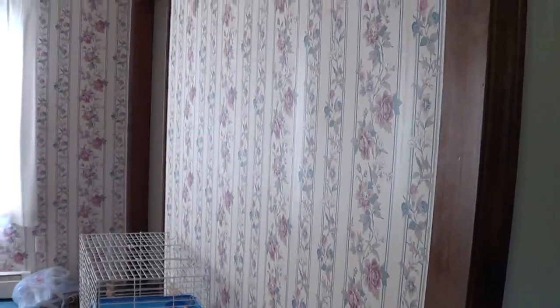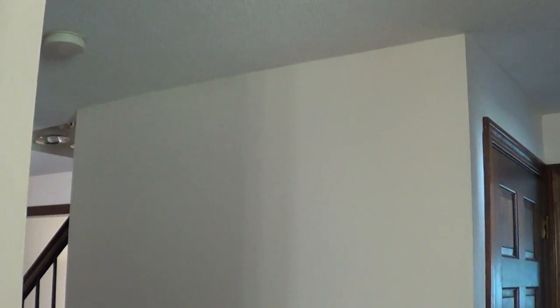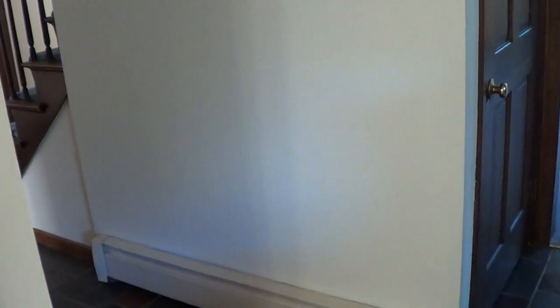This is the dining room — the last paper in the house right there. The hallway was super, super simple. You just grabbed the piece — the walls were painted behind there. It was a totally different kind of paper with a very mild glue. It actually looked like really nasty paper, but we just pulled it and it would come off in sheets. Then you got a bucket of hot water, went over with the dense sponge, and just washed the wall down to remove the glue. That was probably the simplest method, and thank God, because it was the biggest area — the hall and everything going up.